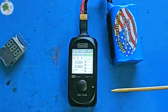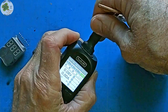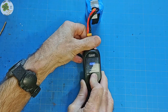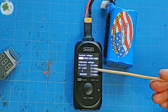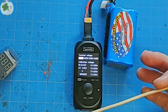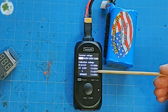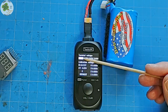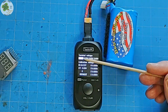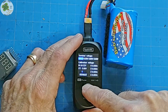We just covered three of the four functions using this button. For the fourth function, we need to disconnect the power source, then hold this button down while we reconnect the power source, and a new screen appears. Its design use according to the user's manual is to change the terminal cutoff voltage and perform manual calibration of the M4 charger if needed. In my experience the chargers come accurately calibrated from the factory, but you can change these numbers after using a voltage meter to measure accurate cell voltages. I'll change this LiPo cutoff voltage from 4.2 volts to 4.15 volts since I primarily use LiHV batteries and lithium ions — I press and hold the button, then short press to get to 4.15 volts.